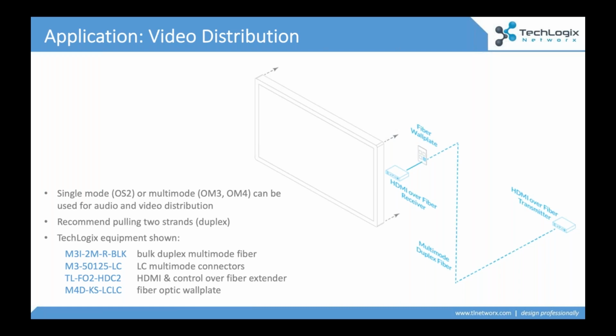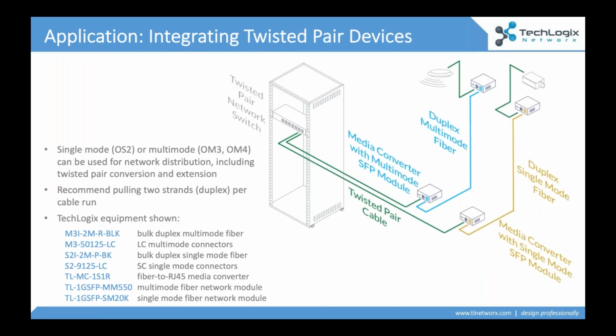So when we get into the commercial application with the cameras, USB SuperSpeed cameras, you get into USB over fiber. I will tell you that when the fiber is being used, it's not being left dark. Most of the time, what's being connected to it are RJ45 devices. They're security cameras. They're access points. They're gate relays. There are all of these devices that are what we would call traditional network devices that don't have fiber ports, that have RJ45 ports. This is where media converters will become your best friend.